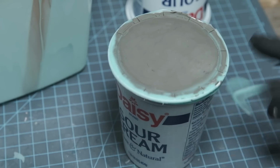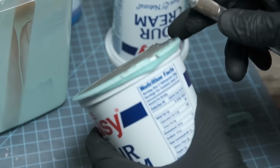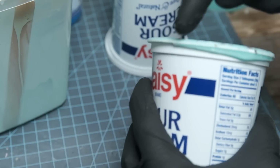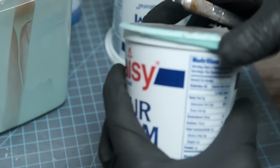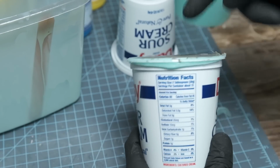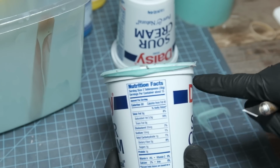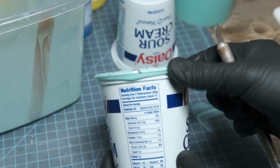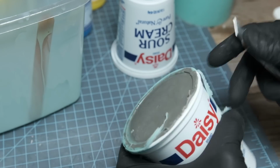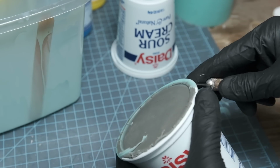And so the way I make these molds, just so y'all know, is that I like to have a good top on it, you know, so it's a good lid. It's got a little bit of weight to it. For example, with this container right there, you see how it goes down slanted. And normally what I would do to make my lid is just to put some tape or something, a little retaining wall around the top, and then pour my other silicone. But you see how it's slanted? However, that top ring right there is straight. So that's kind of like a reference edge, you can put your tape on it. It will make sense in a minute, hopefully.